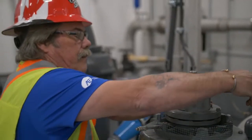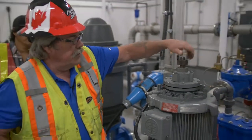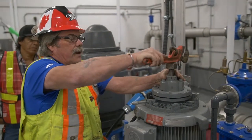Remove the nut — this is left-handed thread. Make sure it's nice and loose. You should use a no-mar hammer with this. Just make sure the impellers are right down.